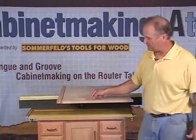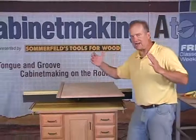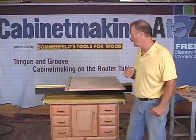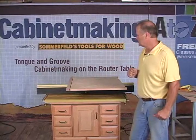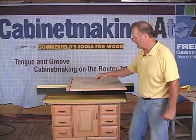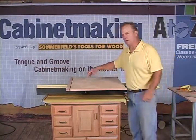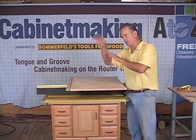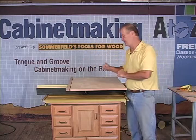I always make these a little bit wider than what they're supposed to be. I cut it to the exact 27 inches by 31 and a half. I believe that's what the dimensions are in the catalog. So that's how easy it is to make that top. Then lay out all your holes, drill the hole for here, and you're all set now to plop this down, put on your cabinet, and install your router table.